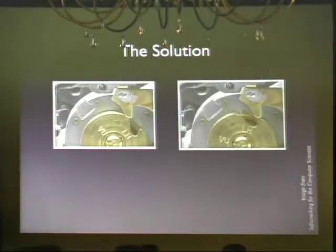In which case, that guy goes out of business, and he's very sad, and he stops buying locks from this manufacturer and tells all his friends who make safes not to buy locks from this particular manufacturer, and so they have to make sure their locks work every time. This means that they rounded the corners of the gate so that everything would work smoothly every time. This has the curious side effect of allowing you to measure very precisely how far the fence has dropped inward into the wheel pack. That is to say, how close the fence has gotten to the center of the spindle.